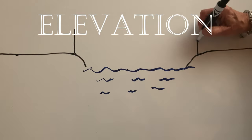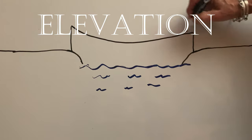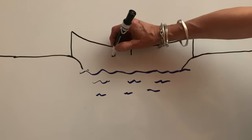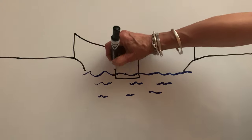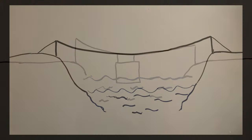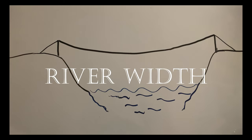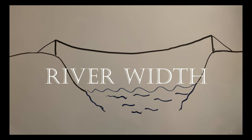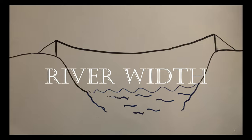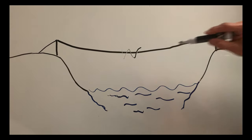The first is elevation. Your gondola has got to be far enough above high water to clear winter storms — allowing for cable sag and calculating clearances from the bottom of the gondola, not the cable, in the river. The wider the span, the more allowances for weight and stress you've got to design into the system. If you under-design, you're going to have a failure. So look for a narrow span — you'll sleep better.